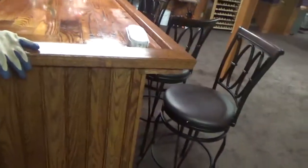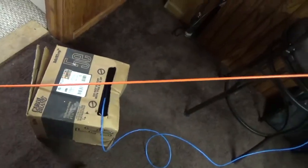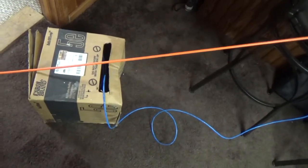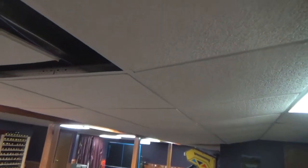Every time I brought it down here to work on it, I'll plug it in to direct wire and it just instantly works without a problem - it will make a great extension but only if it's hardwired. What we've got here is a box of Cat5e that I've had for quite some time, and some fish poles - these are fiberglass fish poles. I recommend you use gloves when working with them because they are fiberglass. You just tape Ethernet to it and you can use that to push it through ceilings and walls, makes it a lot quicker work than trying to go tile by tile.